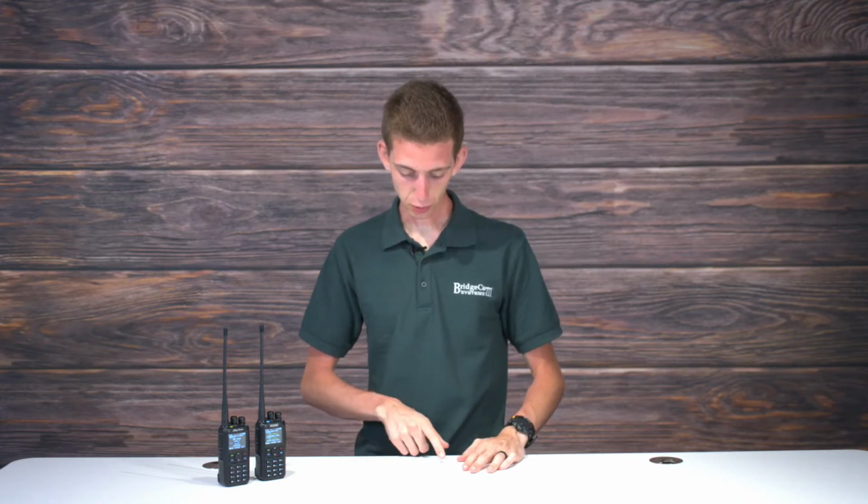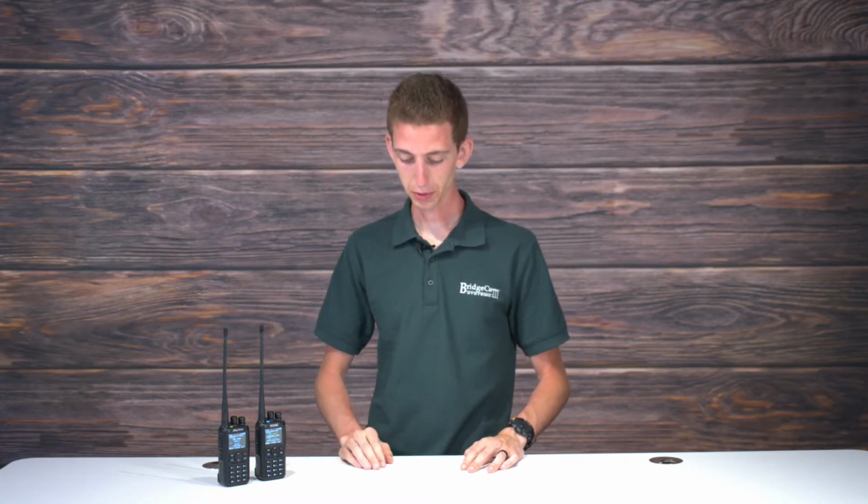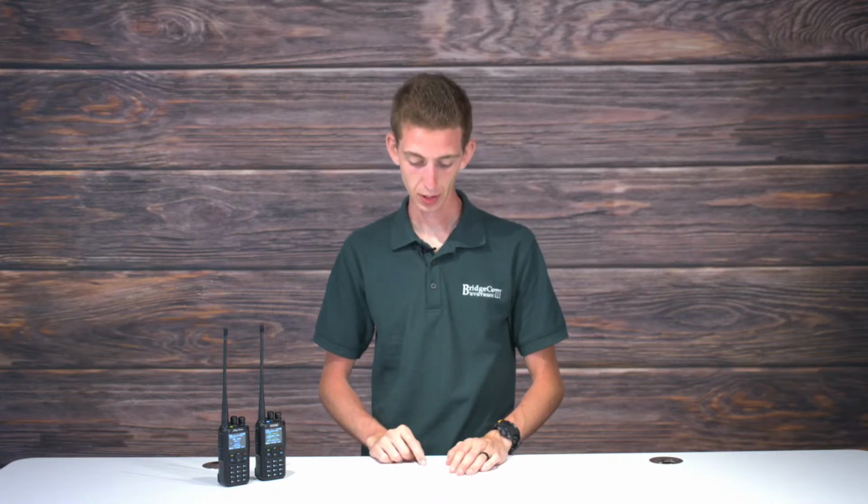We should cover some potential problems real quick. Not entering the same frequency and tone in all of your radios, because you can set up 1, 2, 3, 4, 10 radios, it doesn't make a difference. But if one of them has a different frequency, it's not going to work. Or only setting the receive frequency. I've seen people do that before. They set the receive but forget the transmit.